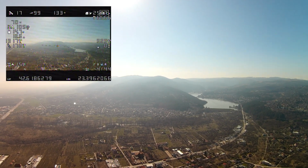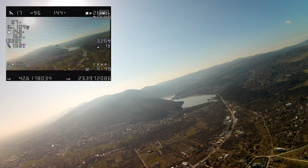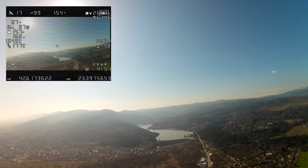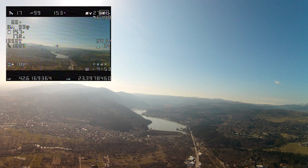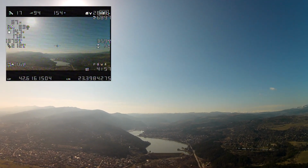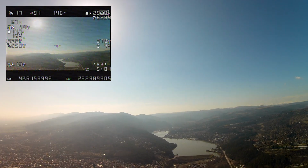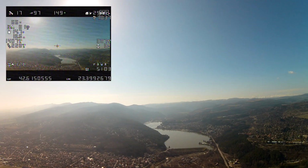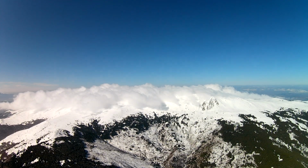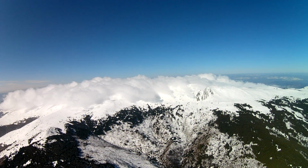Now, since I had a good deal of battery left, I thought I'd move off into the distance a bit and try to gain some altitude, and guess what? It is now easier to get over 90 km/h speeds, which means I can actually afford to pull on that elevator without worrying that the speed will drop to 30 km/h and the plane will stall. And it also now, as a result of having more speed, climbs better and faster.